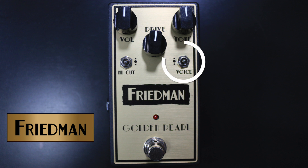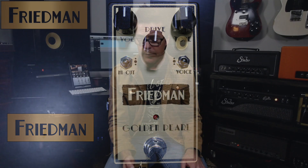On the right side, you have a voice switch, which allows you to choose between either a silicon diode or LED clipping. In the up position, that's your LED clipping, which works better for clean amps. In the down position, you get diode clipping, which works better into the front end of broken or slightly overdriven amplifiers. And in the center, there's essentially no clipping — you're just using the volume and tone to push the amp.